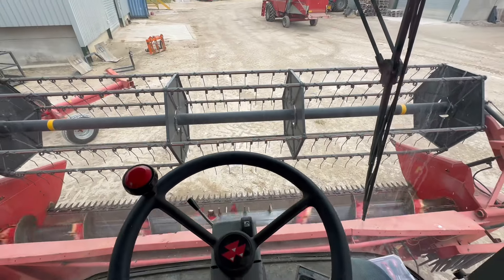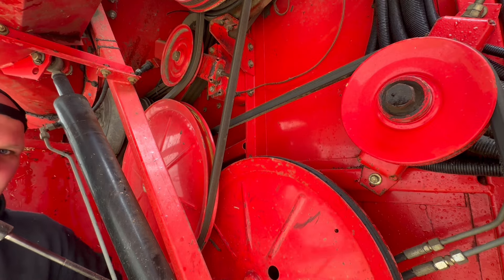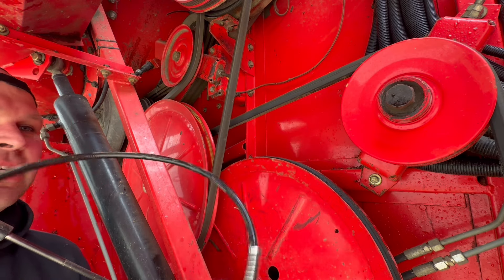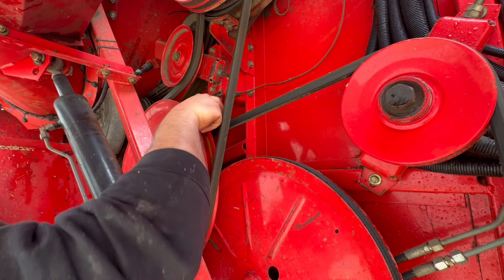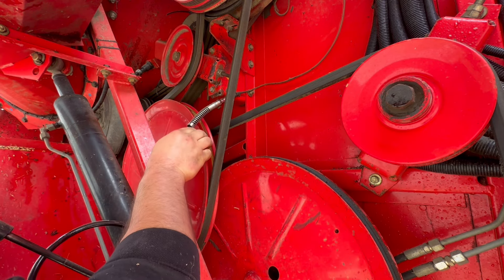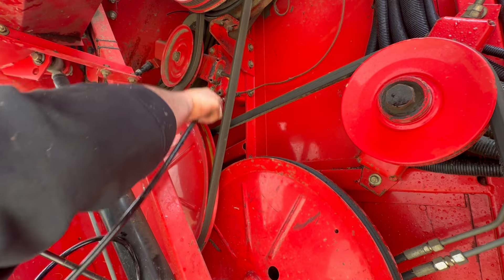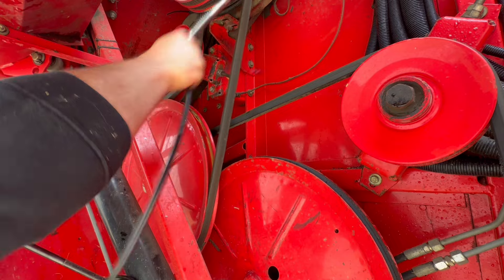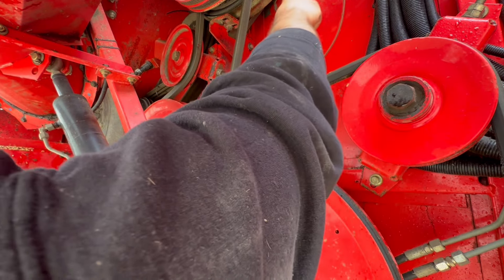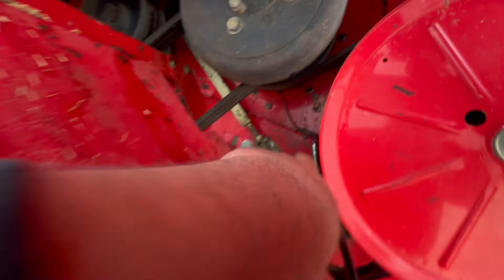So all we need to do is grease it. Remember we've got this big Milwaukee — not Makita — grease gun. So here's the first greasing point. I did grease it before I put it away, but now I can't get that off — there we go, it's off. So that one there goes up this pipe and up to a couple up there that we can't quite reach. There's another one just here — it goes up there. There's another one on this shaft here.